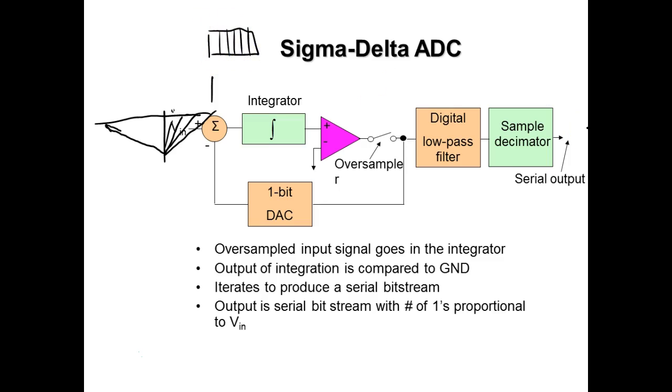And then what does it do? Switches back over to the reference voltage, right? You understand. Integrates this way, switches up to your voltage, charges the capacitor, switches off. Then it starts counting until it crosses zero again. So your meter is constantly doing this. You ever took a pot and turned it real fast and waited for your meter to catch up with your pot?